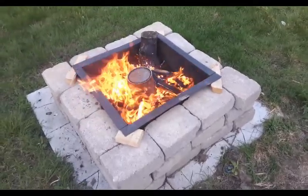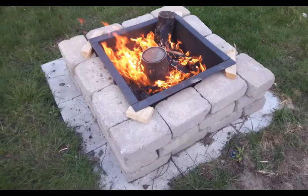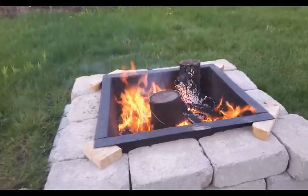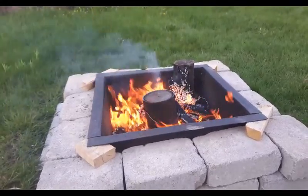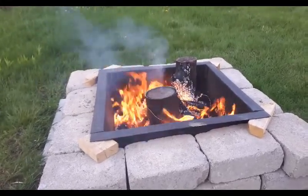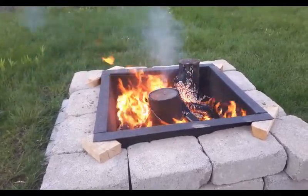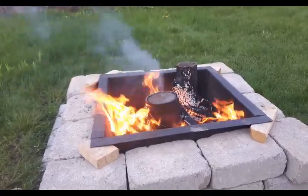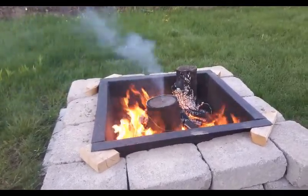It takes about an hour and a half — I'll give you updates as we go. Okay, we're only about maybe fifteen minutes in and you can already start seeing the wood gases burning off. That's what's coming out of the hole in the middle there. It's very important to just have one hole, because all you want is that stuff to come out — you don't want any oxygen to get inside the can. It sounds pretty wild; there's just a little jet coming out. We'll update it as we go.